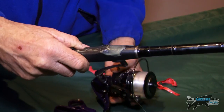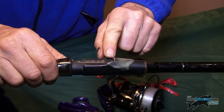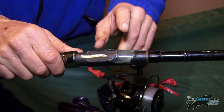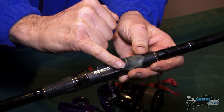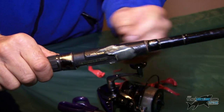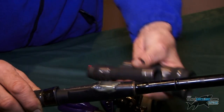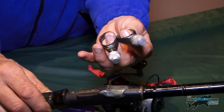Anyhow, what he's trying to repair it with looks like some 2-part epoxy resin, like araldite or something like that. Well, that's fine. It's good for gluing stuff, but what it does is get very brittle, and you can see it's broken away totally there. So what I'm going to do is take this all off here, if I can, and replace it with another fitting like that. It can be one of these 3 fittings, but failing that, you can get some things called coast locks, and I'll show you how those work as well.